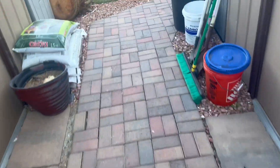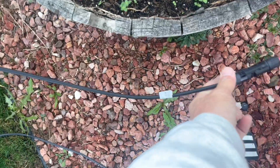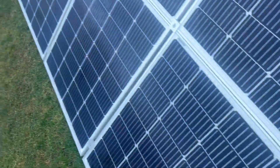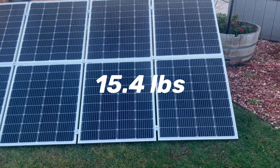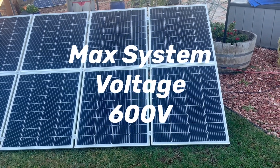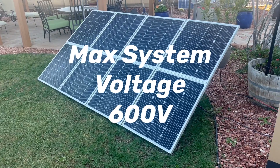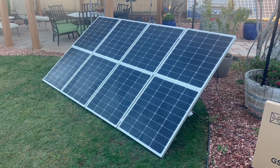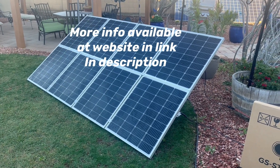Looking at the connected panels up there, it's a good 36 inches or more of MC4 wire. At $50 a piece for a 100-watt, 5.5-amp panel, it's a pretty good deal — most comparable panels are two to three times the price. I bought 12 of these and I'm using eight of them to charge two EG4 lithium iron phosphate batteries in a battery bank.